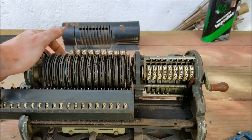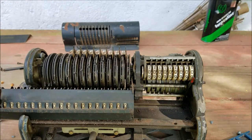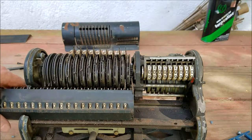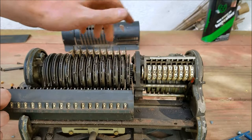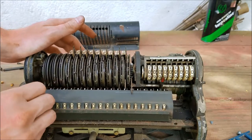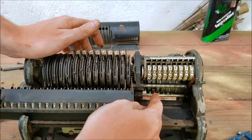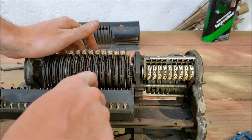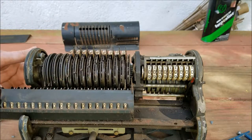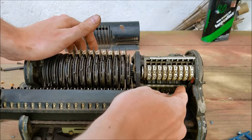This is not in the right place — I don't have the spacer on right now. So let's see if we can figure out how this comes off. If you notice, this pointer moves along with the carriage. This rod is attached to a geared shaft back here which is driven through a gear off a geared track on the back of the carriage. That's why this blocks here — because this hit the end.